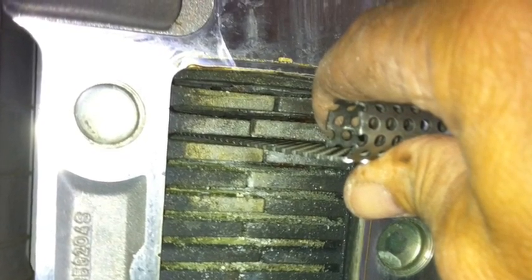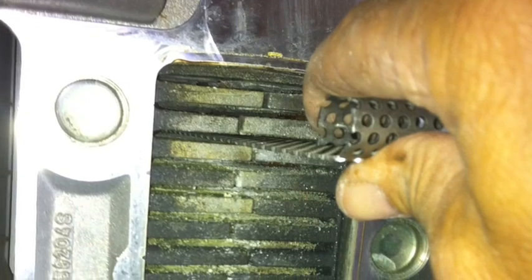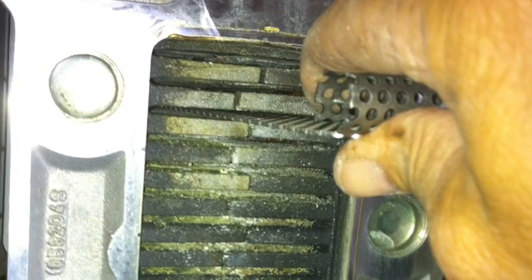This is the tool we use for doing the job. I'm going to show a little video after this just to show how it should be used. So here we are in the cleaning process of the heat exchanger. This is mainly due to bad servicing and all this build-up. It should be done at least every couple of years to clean these fins, but this has obviously never been done. And it's the main culprit for this lady getting the EA problem. So a good clean - take your time over doing it - and it will pay dividends.